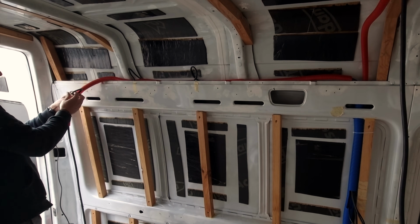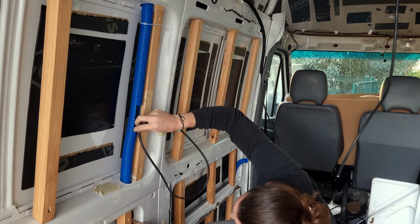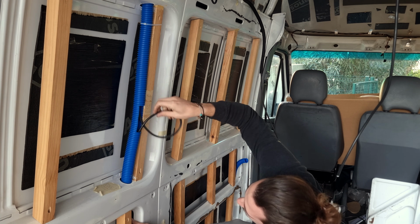And the second tip is to leave a little bit more wire than you think you're gonna need. I like to do these little loops in the places that I know that I'm gonna be doing connections, either to lights or switches or whatever it is, just to have that little bit of extra space to allow me to maneuver and make the connections without having to pull on the wires and push things from other places. Just make my life a lot easier.